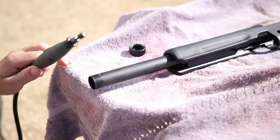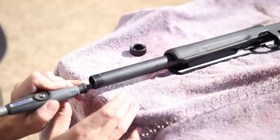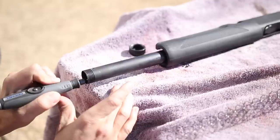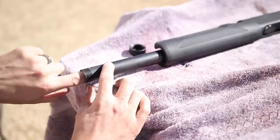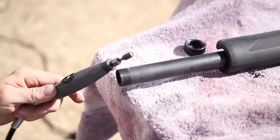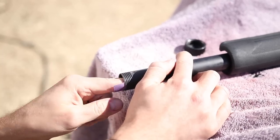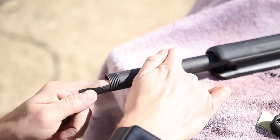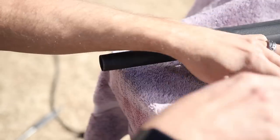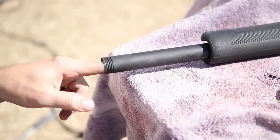For this task I'm going to be using a Dremel with a flex shaft kit and a small sanding drum. You definitely don't need this kind of equipment — you can use regular sandpaper wrapped around a pencil or a round file — but this is going to be a little bit faster and more graceful. After grinding, those little dimples feel pretty non-existent. The sanding wheel is about 120 grit, so I'll go up through 220, 400, and then 600 — not going for super pretty, just going for super smooth and functional. That is smoother than the rest of the inside of the magazine tube.